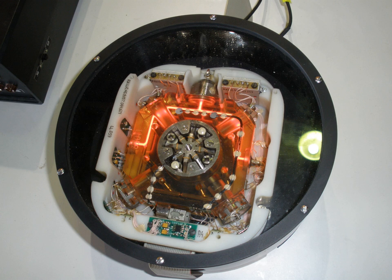However, the sensitivity of the fiber-optic gyro is enhanced several times over the RLG by having a long optical fiber, coiled for compactness, in which the Sagnac effect is multiplied according to the number of turns.